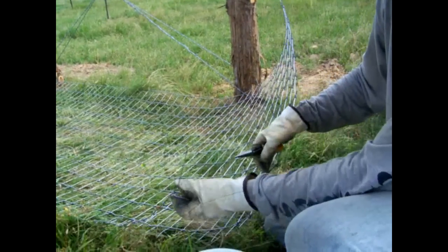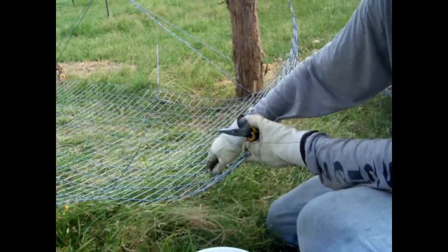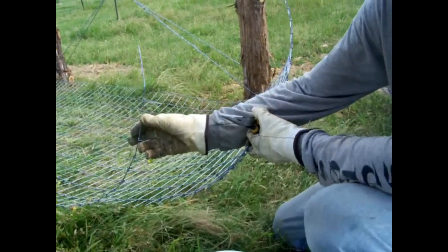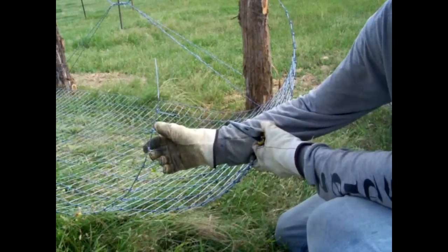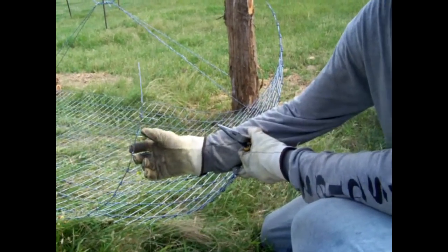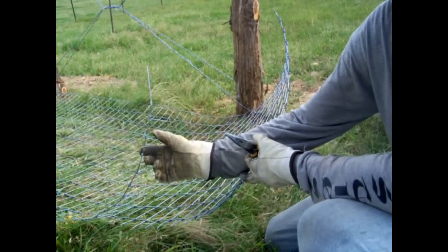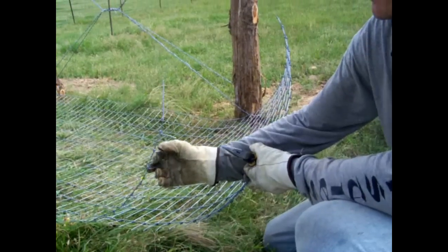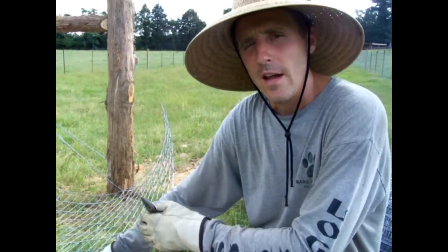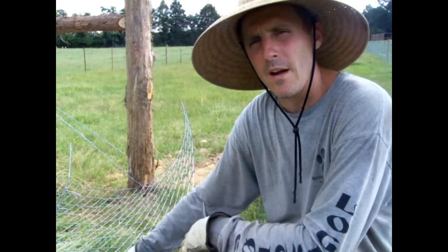So what we've got here is 13 strands of wire, all tied together in a grid pattern. We're only going to tie five of these to the H post. The first one I did I tied all 13 and it took forever — I didn't see an actual benefit in strength. I called the manufacturer and they recommended between five and seven wires based on what I'm pulling. They said the reason for the strength is the grid pattern itself ties together, and I'll show you how we ensure the grid stays tight so it doesn't slip.